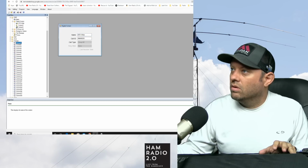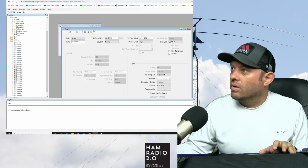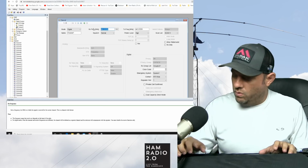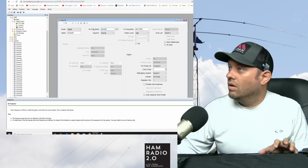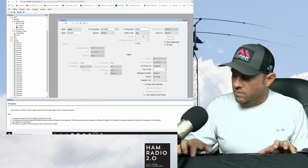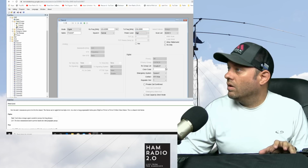channel. And I'm going to, channel 1 is digital. Let's see. 434.450. That's fine. 434.450. Boom. Power level high. Color code. Repeater slot 2.